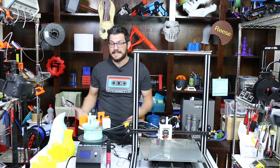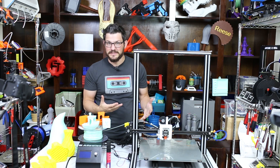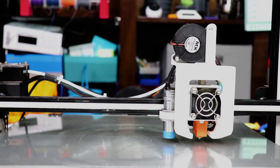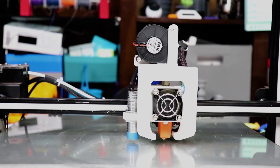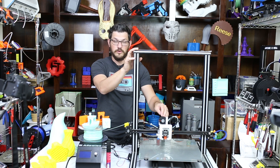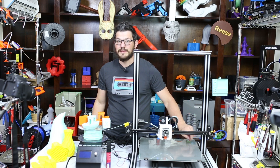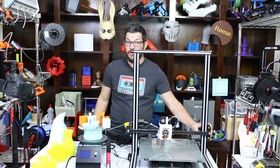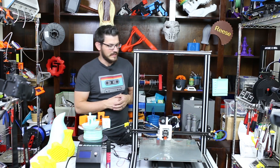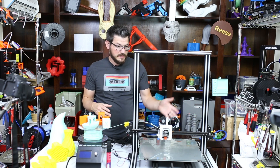Now let's talk about how I was able to get all of this done. This printer is massive — leveling the bed is kind of crummy, not really great, the printer's not well built. So I'm going to put on a TH3D Easy ABL Version 3, which really solves the problem of dealing with the bed being uneven. Yes it does dual Z's but it's just not the greatest thing ever made. I think if I was able to get a 2040 for the X bar and get a new carriage made for it and remake the right side gantry — because this inner wheel doesn't even come in contact with the 2040, there are no eccentric nuts on it whatsoever. Dual Z end stops would be a good start and remaking this carriage would also be a good start.